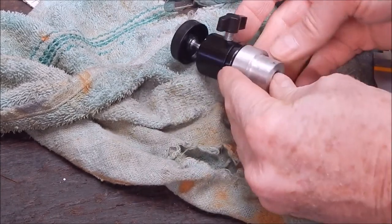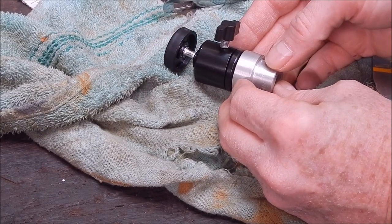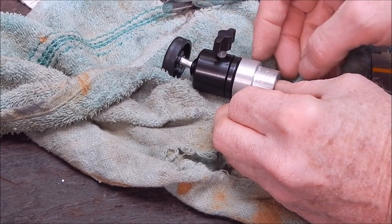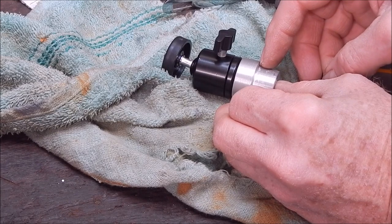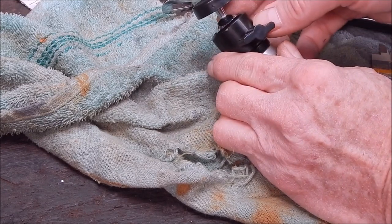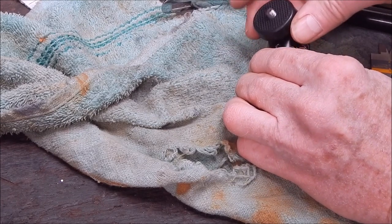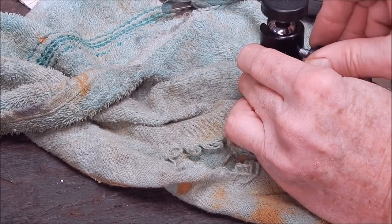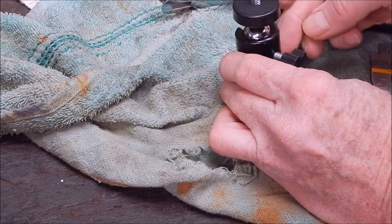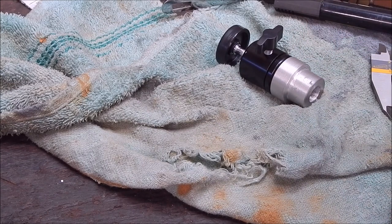Okay, so now we'll fit the aluminium into the leg itself. And I'll do that with this screwed onto this, and then I'll drill the holes because I want everything to line up as far as the orientation of this front pivot point, which lets it come right over. So I want that to come over, have that facing forward, and then have the knob that I tighten up the slide out leg coming out this way. So we'll try and get everything lined up. So I've got this screwed on first before I drill those four bolt holes and tap them.